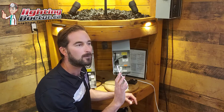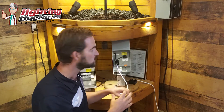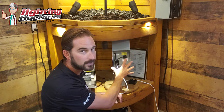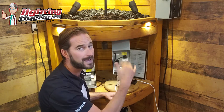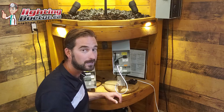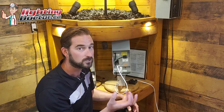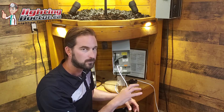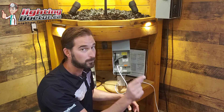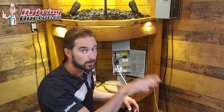In that case you'd want something that's 70 watts or higher. With low voltage LED lights, if you go get a 150 watt transformer like this, you're not going to overload your system. You can easily put 20 to 30 lights on here depending on whether they're path lights, wash lights, or up lights — just add up the wattage and make sure you probably have less than 130 watts on here. Something to be careful of: cheaper lights are not as efficient. Although a light might say 5 watts, a lot of times they're actually consuming 7 to 10 watts. The better the quality of the light, the closer that number is going to be. That's why you leave 20%.